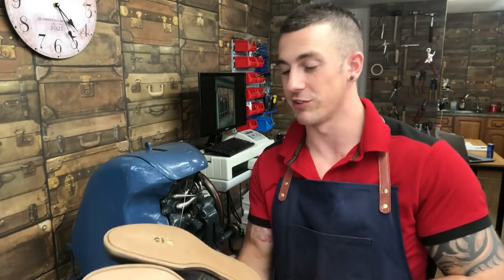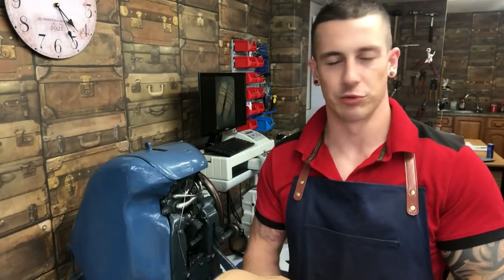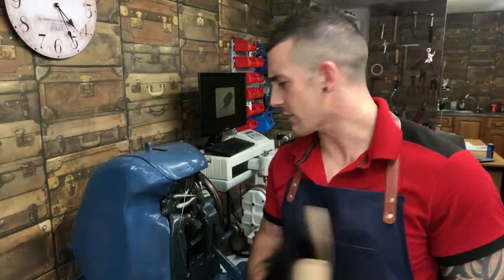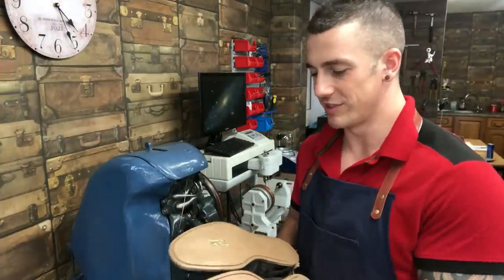I got a little ahead of myself and filmed that step without explaining - putting the groove in. The groove is a channel that goes all the way around the edge of the sole, and that's for the stitches to sit inside. We did it on the machine with a cutter; you have to be very careful not to snag or rip through the sole doing that. Now our stitcher - we're using a Victor outsole stitcher. The reason soles are stitched is that when leather soles were first invented they were only stitched, not glued. Today the glue is superior - you could get away with just glue - but we stitch it anyway because that's how the shoes came from the factory and we're doing a proper job.